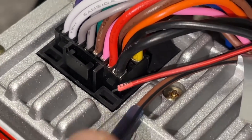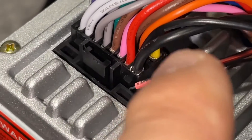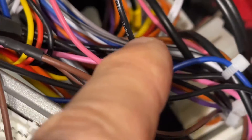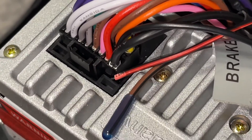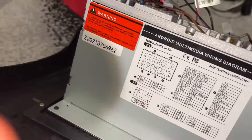Basically there are three wires: red wire, yellow wire, and black wire. The black wire is ground. Red and yellow — you need to connect them to each other, and that's gonna be the positive side coming from the adapter. The ground, the negative one, is the black wire.